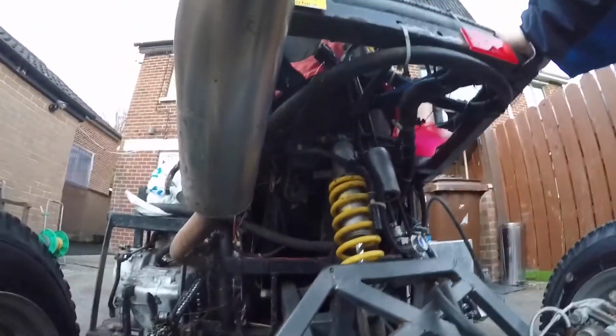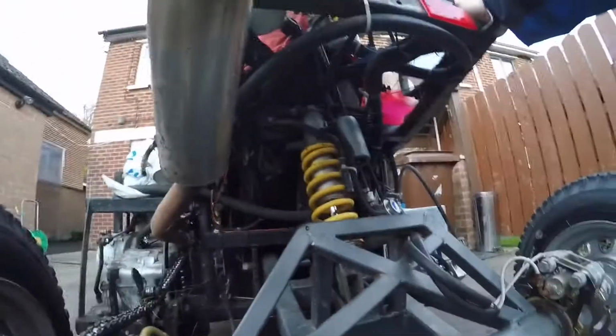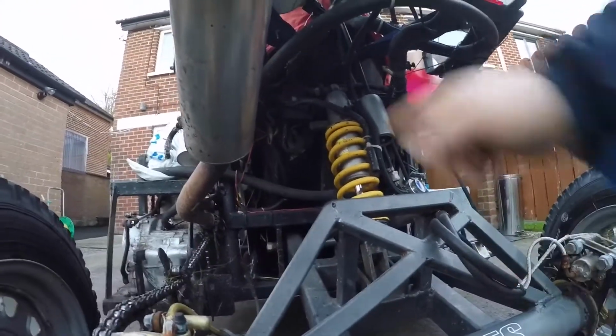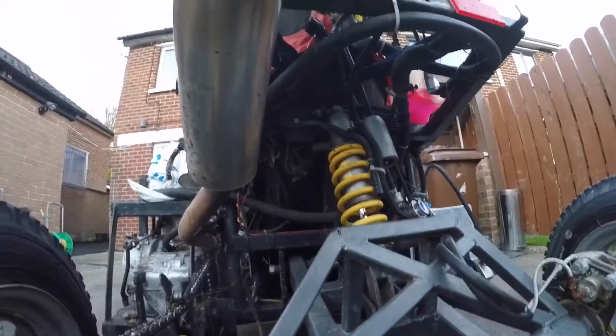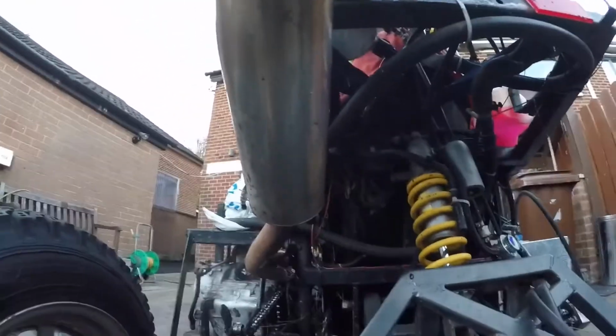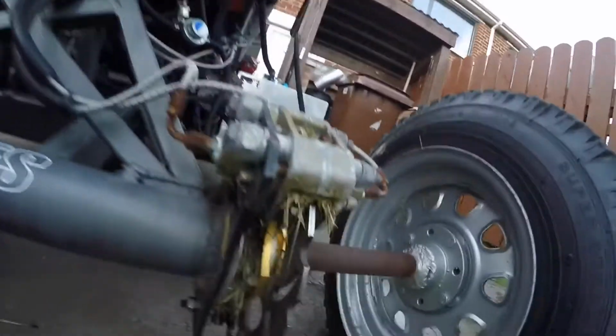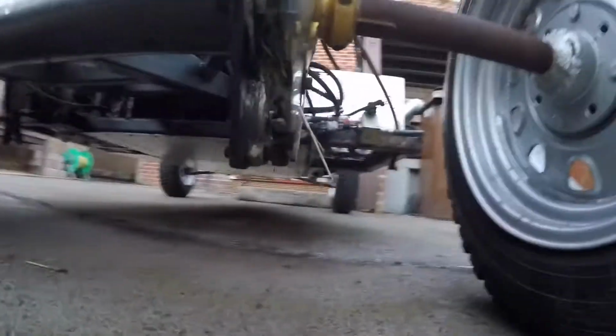The suspension is a motocross shock from a Suzuki RMZ 450, I think, and you make up this swinging arm. It's all in the drawings, and there are nylon bushes for the pivot. You have little needle roller bearings, and I forget the type, but obviously there's one on each side. I also have a wee sort of fin on. You can see it there. It stops the disc getting bashed.